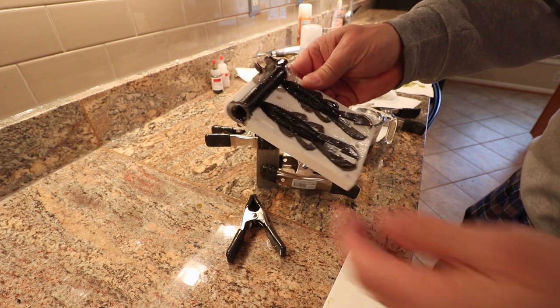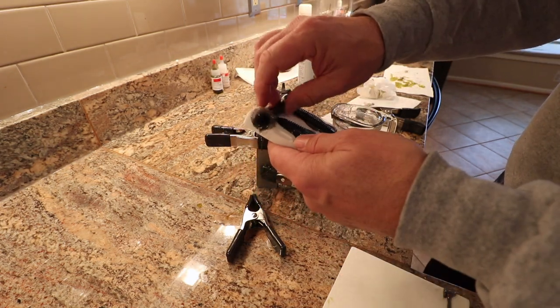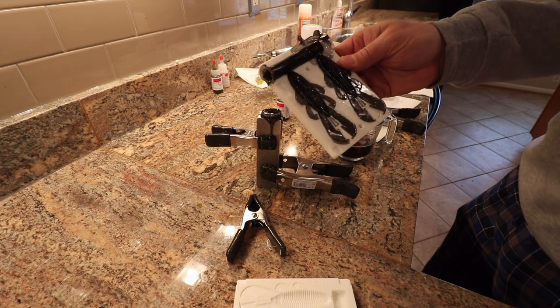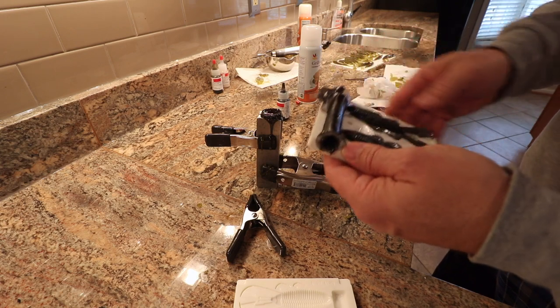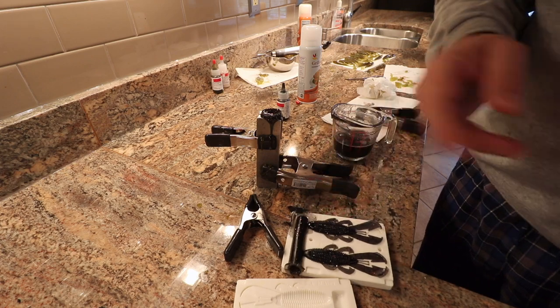All right, so these black Bandito Bugs came out really nice in this mold. I really think the key to a quality pour on these ceramic molds is definitely putting a little bit of grease or non-stick spray in there — it seems to let the plastic move around perfectly. I'm going to go ahead and set up a mat and start cooling these down, but those look great.